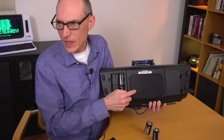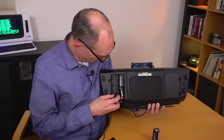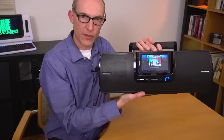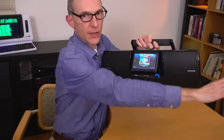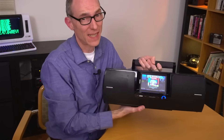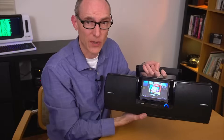I also noticed that it has a really nice woofer or subwoofer on the bottom. So, here we have a Pi 3B Plus with a 5-inch touchscreen running on D batteries — no wires — being very portable and heavy. In case you were wondering, 8 brand new D-cells last less than 2 hours in this configuration. That's around $10 an hour in batteries, so not a very cost-effective power source.